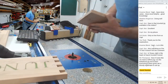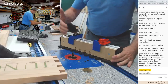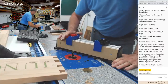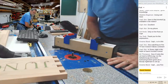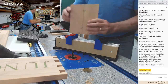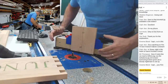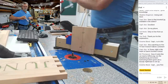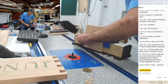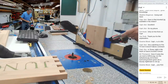All right. Now, instead of being here on the dovetail side, we need to turn the jig around. Very important. So now our red stop is going to be on my right hand side. Okay, red on my right. Now, we need the face mark pointing to the red side. Okay, and the clamps into there. I'm pushing down before I put all the pressure on.